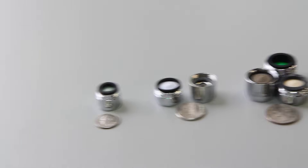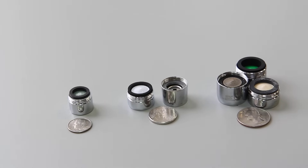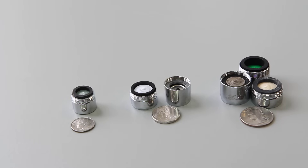Once you have the size, you can decide on the flow rate and the flow style. Flow rates are relative to the application — kitchen sinks need a higher flow rate than bathrooms. Flow rates are available from 2.2, 2.0, 1.75, 1.5, 1 gallon, 0.5, and 0.35. Flow styles are aerated, single stream laminar, and multi-stream laminar spray.